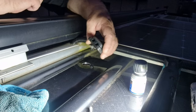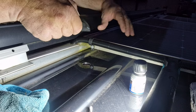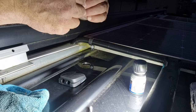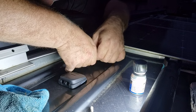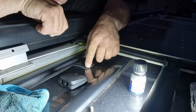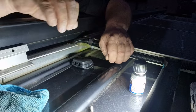Nice and clean. We're going to mount the Scanstrut pointing backwards — for me that's the best way to have it. Given the direction of travel, any wind and rain is going to be driving into it, so if we can keep the seals to the back I think we'll end up with a better job. We've left a gap so any water that builds up will run past it and won't pool around it.